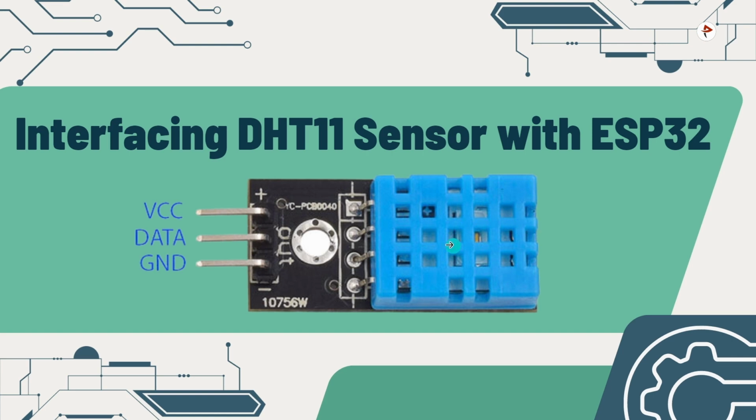The DHT11 and DHT22 sensor has a simple digital interface and it is easy to use with microcontrollers and single board computers like Arduino, Raspberry Pi and others. It communicates over a one-wire serial protocol and provides accurate and reliable measurements. The sensor is widely used in various applications such as indoor climate control, weather stations and greenhouse automation.